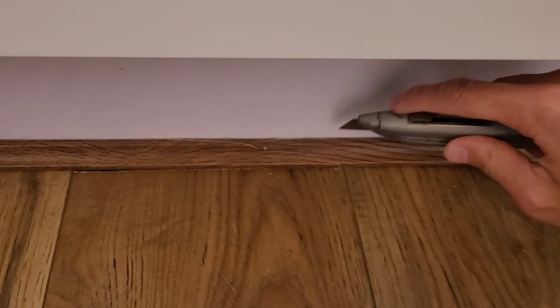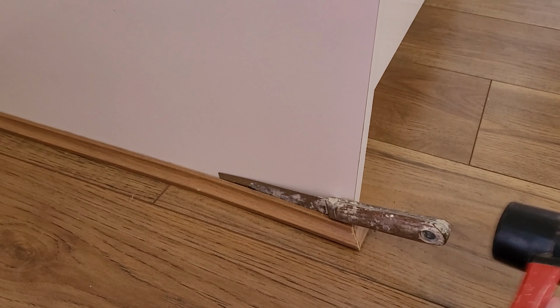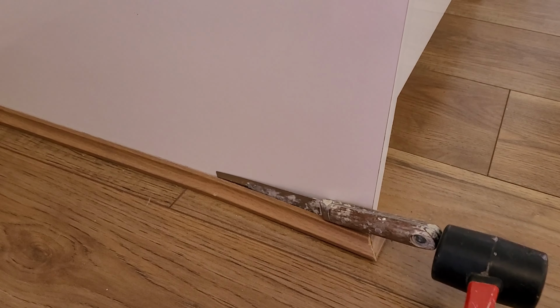If you have stuck laminate moulding onto plinths, the process is similar, but it might be a harder process because plinths are often pre-primed, and a lot of this pre-primed layer can simply come off when removing the moulding. As a result, I took a lot more time removing the moulding here. I firstly used a utility knife to cut downwards, breaking some of the bond between the moulding and the plinths. I then used a putty knife to further break this bond and ultimately help remove the moulding.